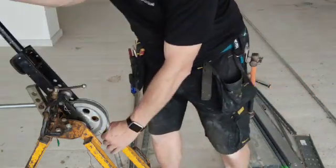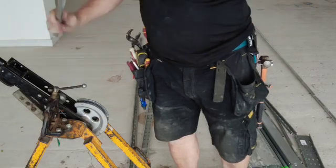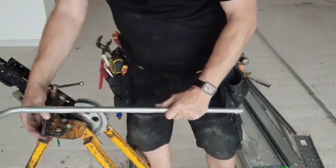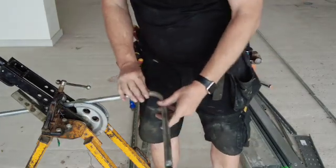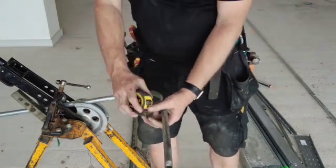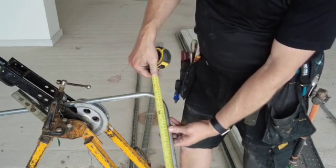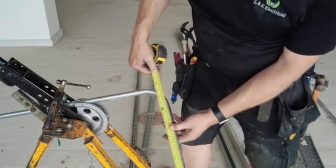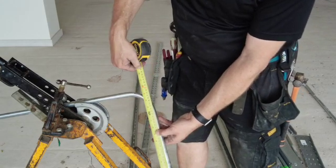It's slightly over, so we've got the back of the bend there. If I put that in like this and we measure, we have 40mm on the back of the bend — and that is how to do that.